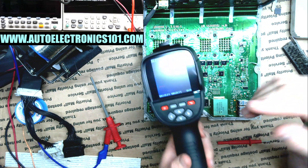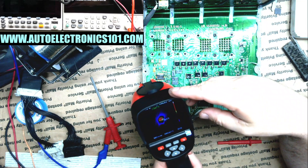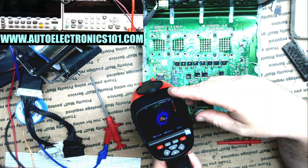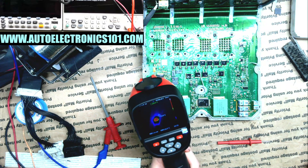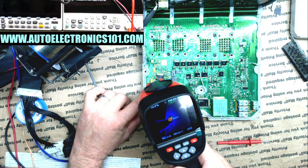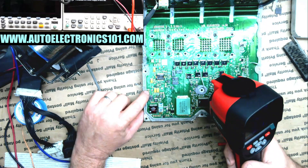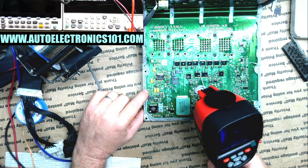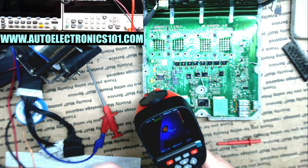I don't like how when you have your target on the max temp, it just tells you 'over' and it's not telling me the temperature — it just says over and doesn't give me the max anymore. I guess it means it's over-temperature, but that doesn't seem right. The resolution is perfect though, because this is going straight to this capacitor right here. Full disclosure — this capacitor is actually damaged. I noticed on my visual inspection that the little corner of it's missing. So I'm not surprised that it's shorted. I don't see anything else, but let's remove this capacitor and see what happens.